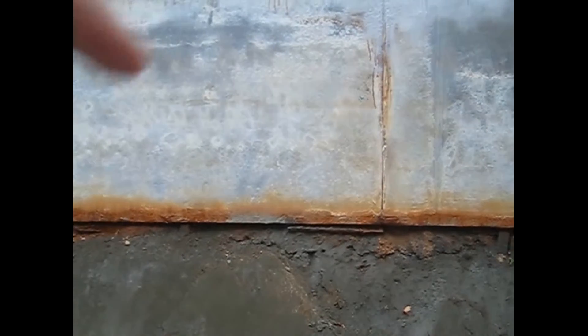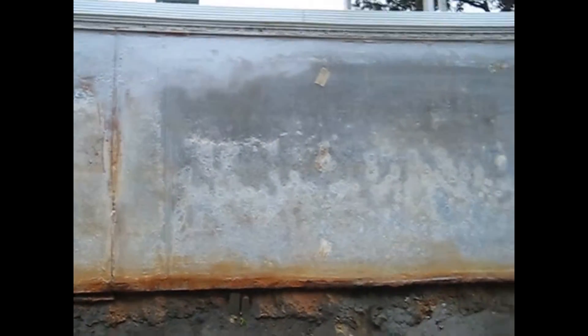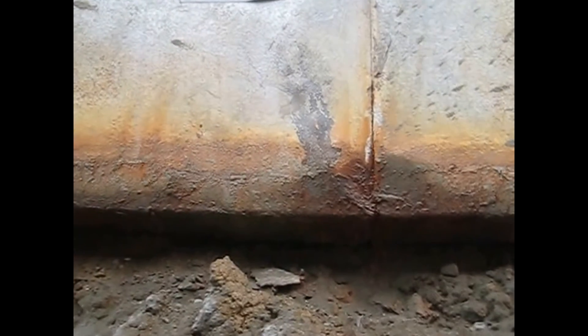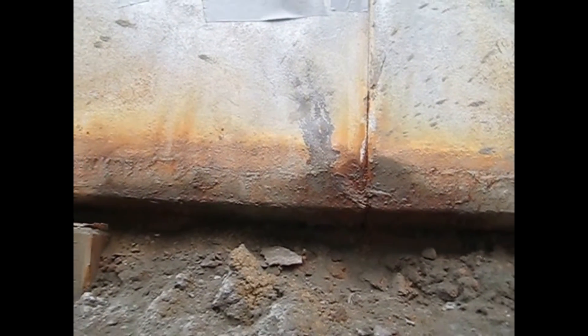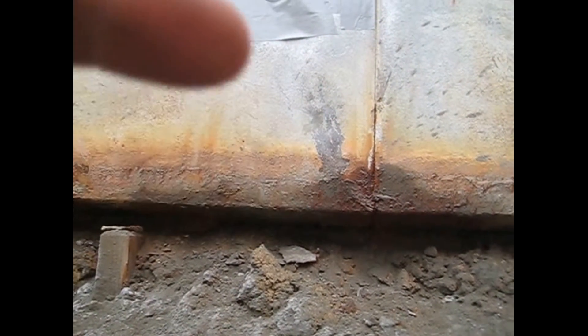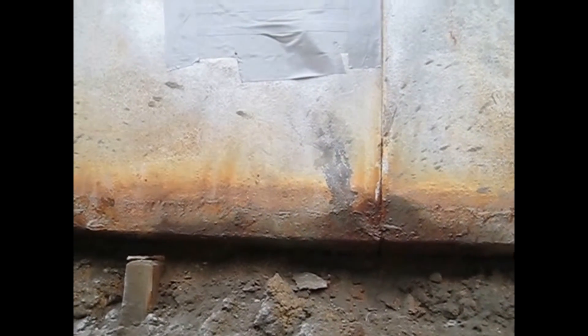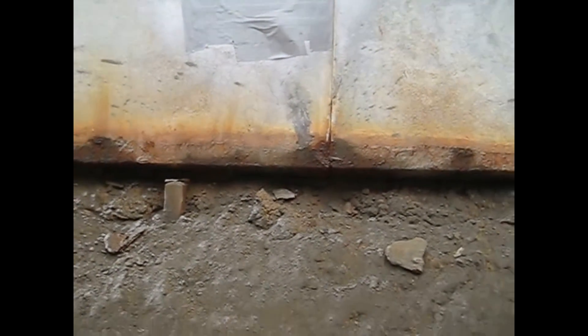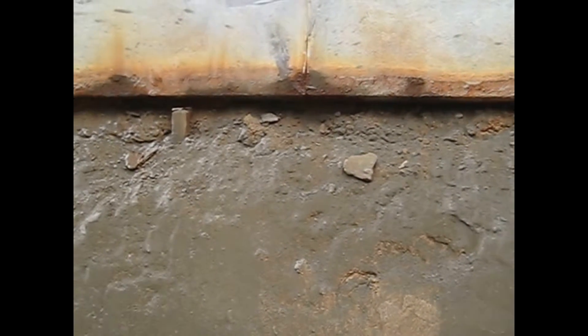You can see here the steel walls, which from here up to the concrete are galvanized steel. And they're able to take movement as well and bending without cracking. You can see here this wall was really buckled before, and in this area we hammered it back into shape as best as possible. So if this was a concrete pool or another type of pool that couldn't take that movement, it would have been cracked and leaking a long time ago.